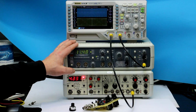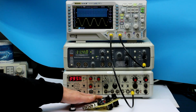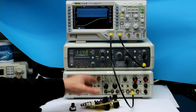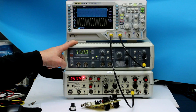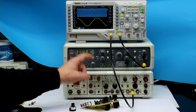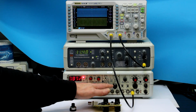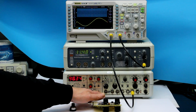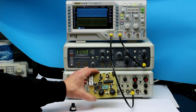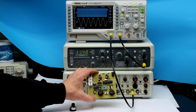And because I wanted to make this thing just as usable as my home built one that exactly fits my desires, I took the last 2 weekends not only to retrofit this with a reciprocal counter instead of the also unusable classical counter, I also rebuilt the circuit that I used here for the sweep generation, just in an improved version. And I would like to know your verdict later if you think it's worthwhile to make a Kickstarter campaign out of that.